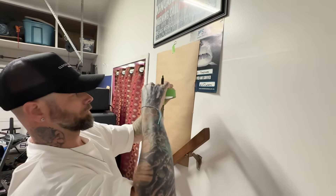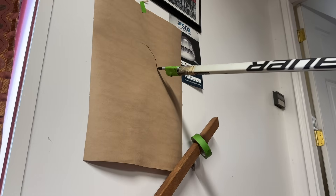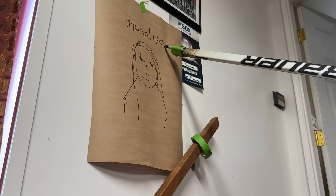If your hand is floating, your arc is dancing. If your wrist is locked to the table, you'll have problems with range of motion. Holding the torch all awkwardly — like you're about to stab a coworker — makes comfort and range of motion way worse. It's like doing calligraphy with a sharpie taped to a hockey stick. You want comfort with range of motion and control with your torch hand. If you start getting shaky and uncomfortable while welding, your torch technique is wrong — reassess, and do not just push through it.